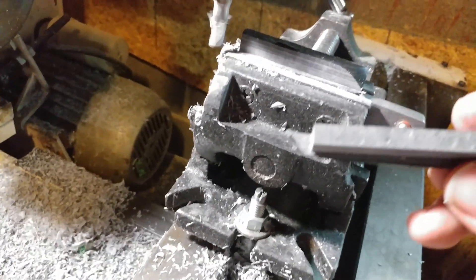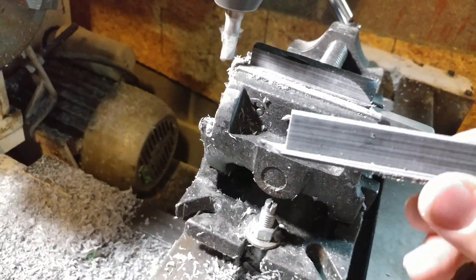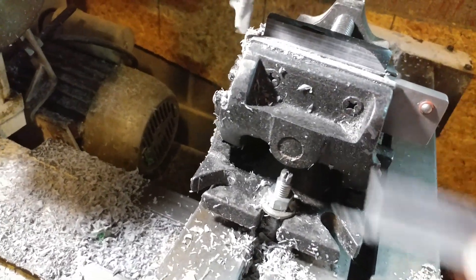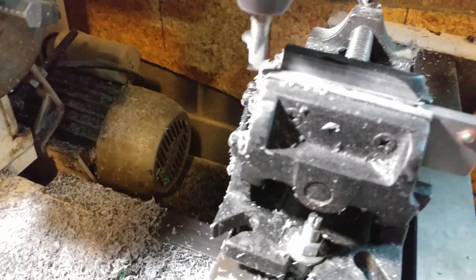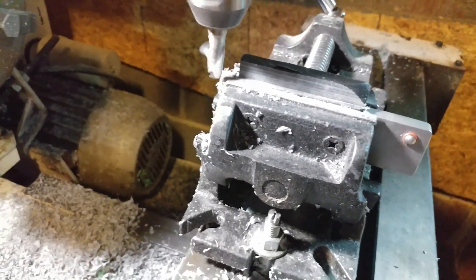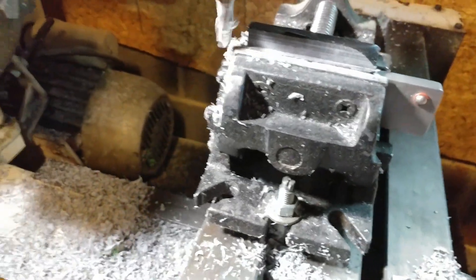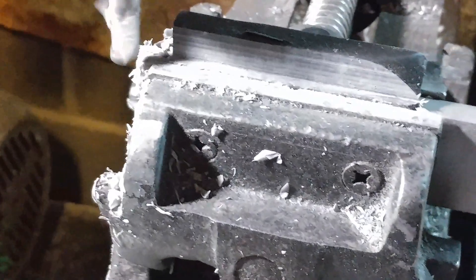On the cutting edge, we're taking this material and cutting pieces out to shape like this, then we'll cut that again and cut the dog bone section out. You've got to get down to about a quarter inch so it holds in the machine, and then they just pull it apart.